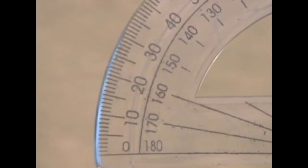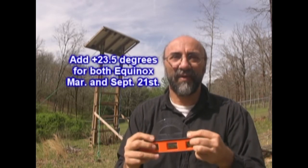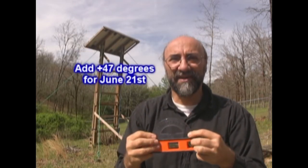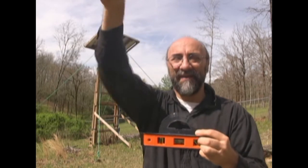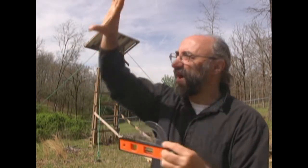You can look right on the protractor and see where 34 degrees is, and you'll know the sun is going to arc from east to west at about that level at the low point in the sky. For the two equinoxes in September and March, add 23.5 degrees — which is really the tilt of the Earth's axis — to find the two midpoints. Then a full 47 degrees can be added to that low point for your June 21st high point, pretty much overhead in most of the U.S. That gives you the exact swath across the sky that your panels need to see clearly.